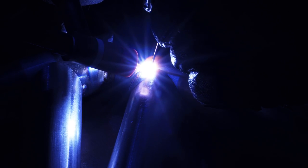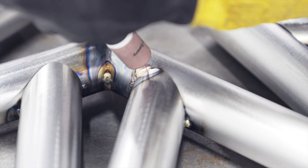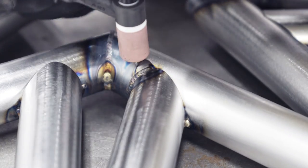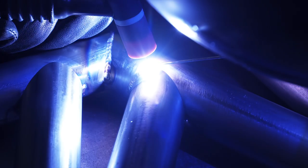I probably shouldn't be touching the tungsten down like this. It kind of pains me to see it. It didn't really hurt the tip or anything because I'm very lightly holding it there. It's more just to make sure the gas keeps pointed at it, but I'm going to work on trying to reposition without actually touching that down.